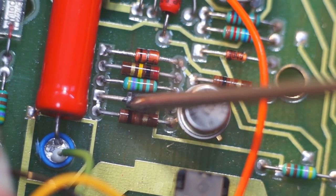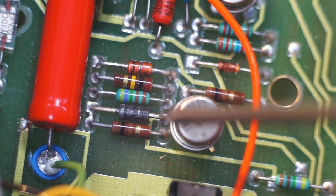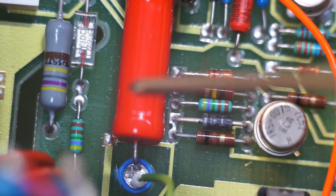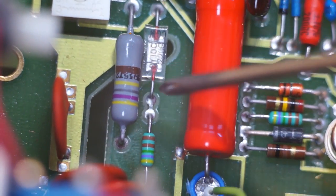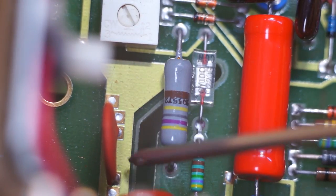You can see we've got like carbon comp, that looks like a diode, though there's several different types of diodes. I guess these are carbon comp. Inductor, there's a bigger diode, though this one isn't glass encapsulated. Weird, more weird jazz. These may be current measuring shunts, actually, now that I think about it. No, I don't think this thing can do very much current. 2 amp max, yeah, so most of these meters seem to be 2 amp max.